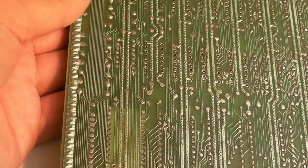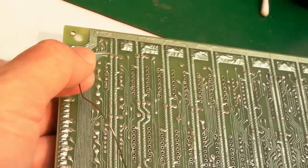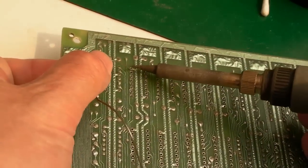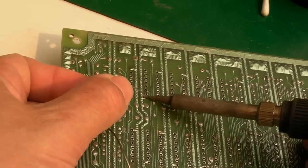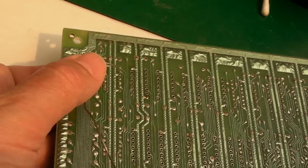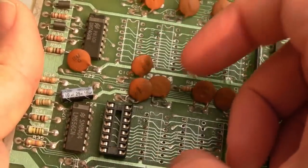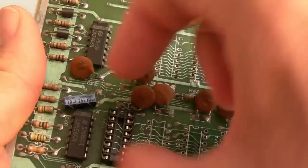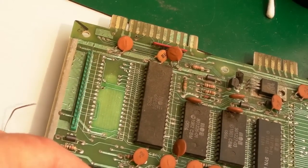Because if you don't know whether your chip is any good, you can swap it easily. You've not committed to soldering it straight on the board. So just solder a couple of points. Press it from the inside upwards as you solder. And flip over, just make sure it's nice and straight. Because if it's not straight, it might bug you. It bugs me when they're not straight. And doing that could avoid that scenario, whereby you feel like you have to take it off.